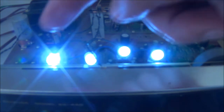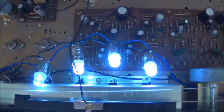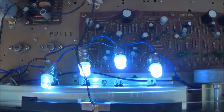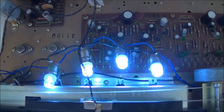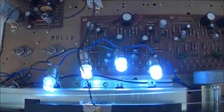Here you can see the difference between the sanded LEDs and the one LED that hasn't been sanded — that's the one to the left. I haven't used sandpaper on that one yet, and you can see the others do make a difference. Taking a look from the top, the three on the right have been sanded and they look much brighter because the light is diffused.